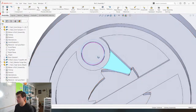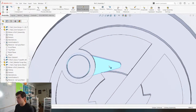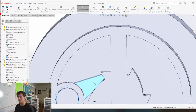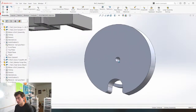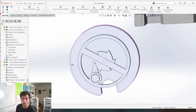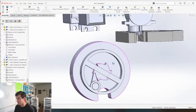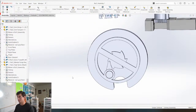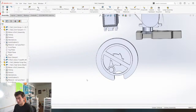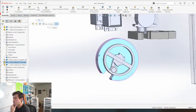So that's gonna go like that, and there's basically gonna be a spring coming from here to here. And that would spring load that down, but it would still allow it to come over here, push this way, and then it will pop down there. Okay, cool, so that's good for that. I thought about doing a 3D printed spring, but I want this to work forever. And I want to print it out of PLA, and PLA kind of loses its springiness after a while. So we're probably going to use real springs here. This whole piece doesn't have to be 3D printed. That constraint is lifted here, which is great. Okay, so the next thing we got to figure out is how to get this to work.